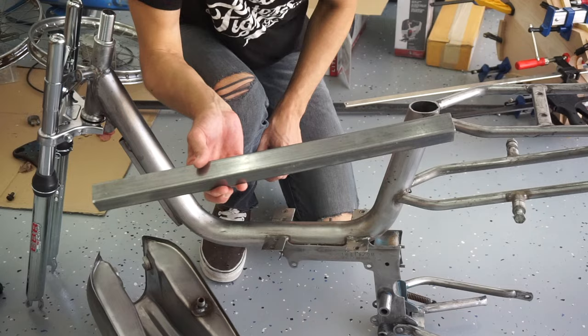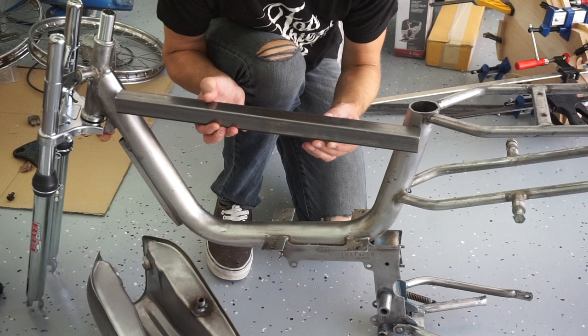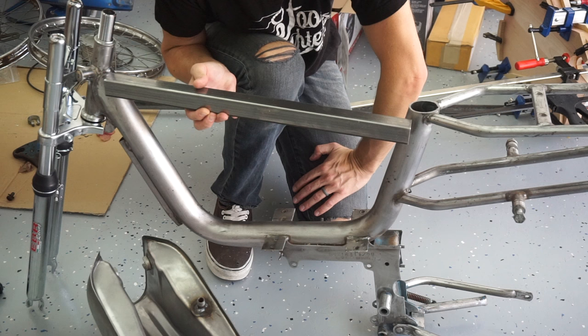That's a huge reason why I love reciprocating saws, or Sawzall, if you want to call it that. So quick and easy. I just took a metal blade and cut the steel in 8-10 seconds. So this is gonna be the piece for this. I cut it a little long because I wanted to see how close I could get and fit it, and then also how I'm gonna do it with the gas tank. So I cut it a little extra long. I'm gonna take more of it off and then shape it to where it just drops right in nicely on the beam.